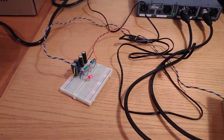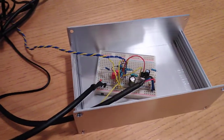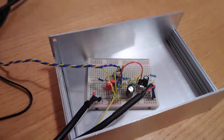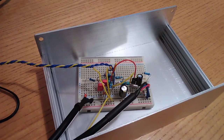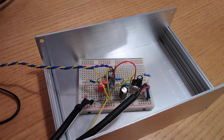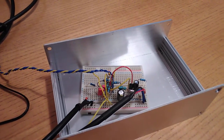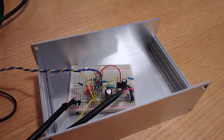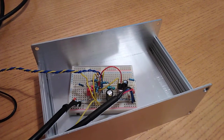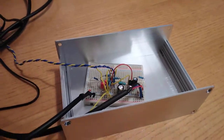So now that we've got our preamplifier powered on all the time, what can we do in a single stage? And you might be surprised. I have worked out a way of adding a second order subsonic filter on the front end, not as effective as a third order one, definitely, but definitely much better than nothing, and very, very usable in most setups to get rid of that unpleasant subsonic disturbance that you get from the surface imperfections of records, which is very, very important if you're listening through anything except sealed speakers, which prevent the driver from over excursion at low frequencies.